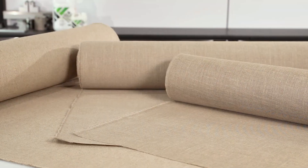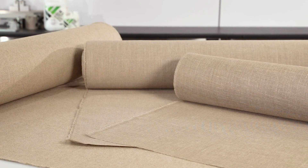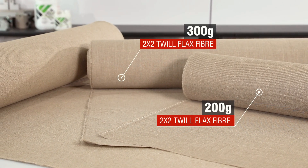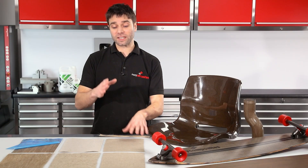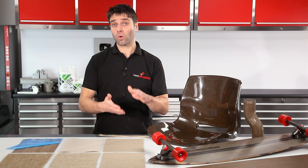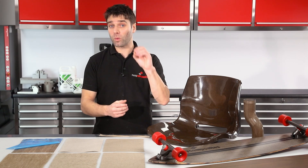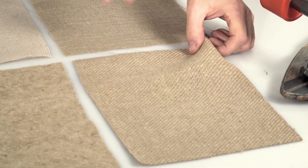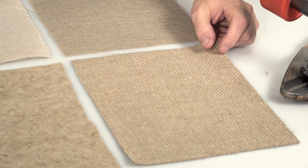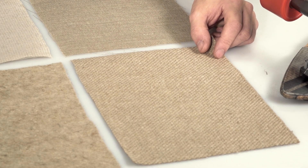Looking at the wovens, these are available in three different weights: 200g, 300g, and 550g. When specifying these materials, do bear in mind that they are quite low density and don't compact particularly flat, so they will provide quite a lot more thickness than you might expect. For instance, the 550g material would give you approximately 1.2mm of thickness.